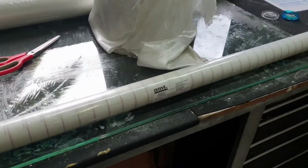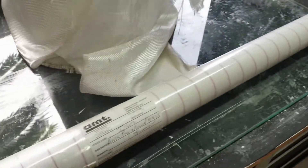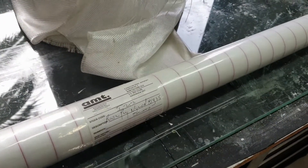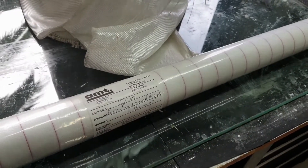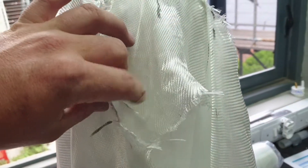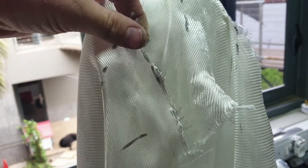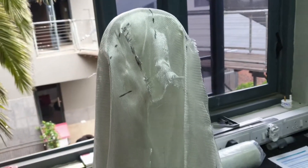I've mocked up the fiberglass draping as best as we can and we're now going to cut out some of the peel ply, which will give us a fairly smooth finish. It will also smooth out these little areas here that are connecting into each other, so all these little frays will be compacted and smoothed in. We should have very little finishing work.